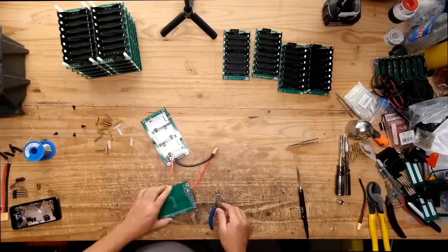But then, see, that's the other part that I don't really like, is the fact that we're soldering these fuses in there. And that's because I haven't been able to figure out how to... I wonder if the Chinese guy can do it. I'm going to ask him. Because what if he can do that? The problem is that that little holder for these fuses is a surface mount component. And these are all through-hole components. And those are easier or harder. I mean, I know that China can solder surface mount components, no problem. They do it all day, every day. That's what they do, right? But I gotta ask my guy. That's right. I gotta put it in my notes.